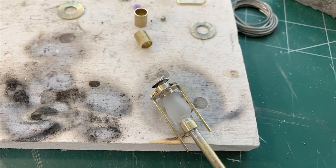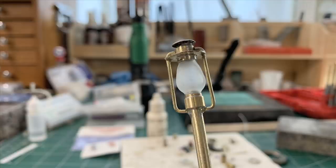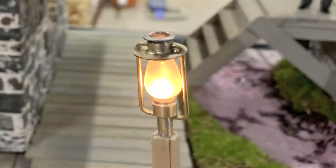And then the gas return tubes will actually bend in and attach at the bottom there. Except from this point, I have to use glue. Yes. Because the glass is there, and I hate to think what would happen if I took the torch to it. Bingo. So I've used super glue here, and I've bent the gas return tubes to the bottom of the font where they belong on a Pioneer. And then those will have to be blended in. And then I shoved the light up through there and took it out to the layout to test it.